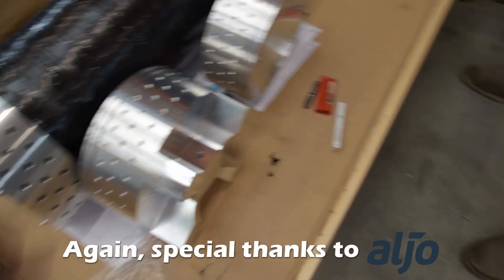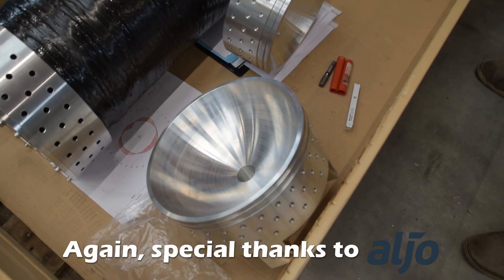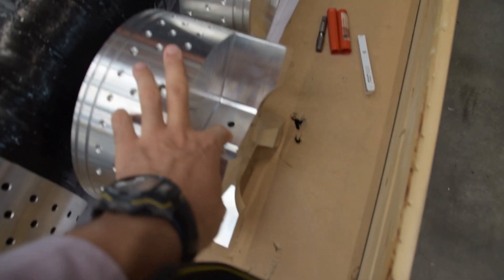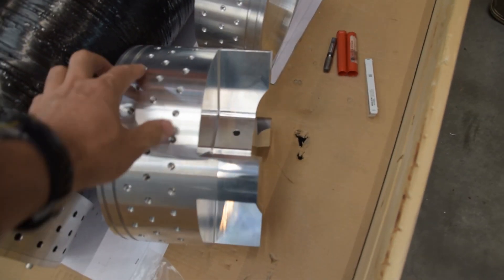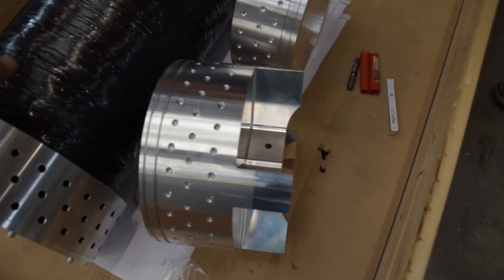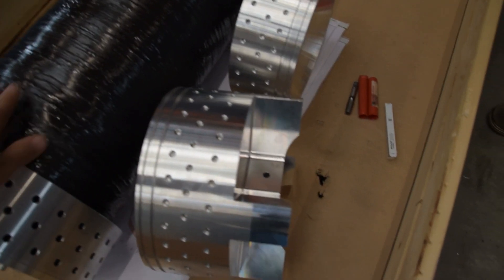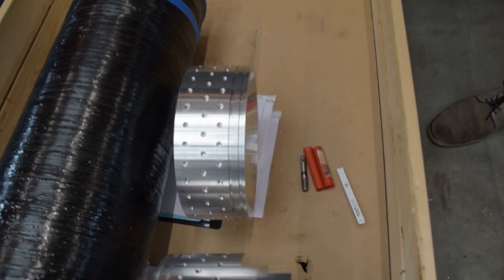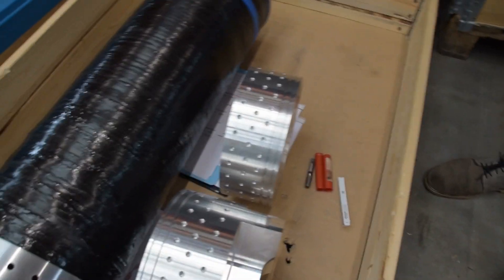You can see how these bulkheads are working. We have one side providing the tank surface on the inside. Then on the sides in the pockets we have holes where we're going to plug in our valves and sensors. And the holes on the side are for screwing the actual CFRP to the bulkhead. When you put it all together, this whole piece will be covered with the CFRP and you'll only see the pockets where we put the valves in. This upper part is only about five or six kilograms — this is why we like to make rockets out of aluminum, because it's actually quite light for the strength of the material.